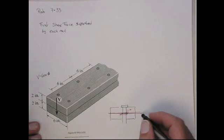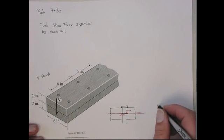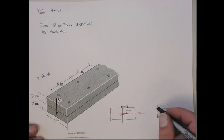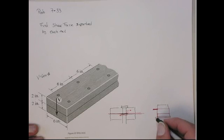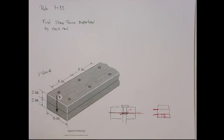That's the point where, if I draw the free body diagram, this upper board puts some shear force on it, and there's a balancing shear on this surface area that picks up that nail. So we need to compute the shear right at this plane. The bending shear acts on this plane, and it happens to be at the maximum — the neutral axis. For example, if it were three boards nailed together, you would need to compute the shear at the one-third or two-third location, which is the plane in which the nail would be shearing.